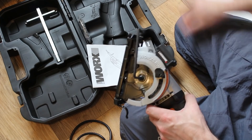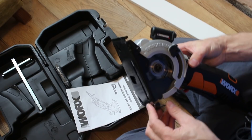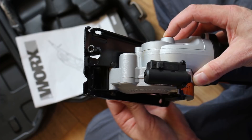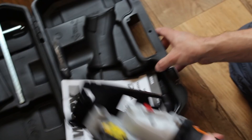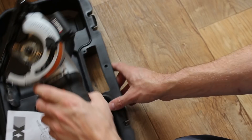This button here is similar to grinders - basically when the blade is moving, with the power supply off, that button can actually lock the blade. Turn the blade and push it in - like that - and if I push it now it means it's locked. I hold the button and now I can undo the blade with ease, take off the little guard, and then change the blade. It's a very versatile tool to have and it's going to come in quite good use for the bathroom.